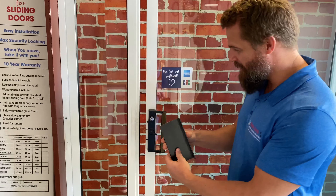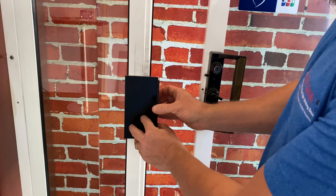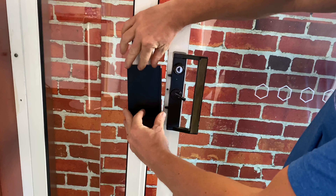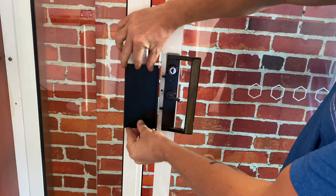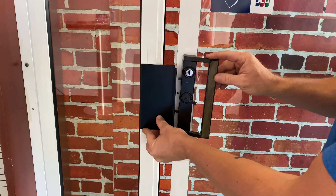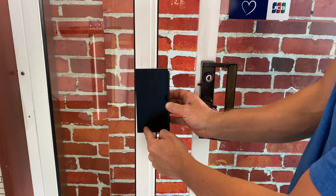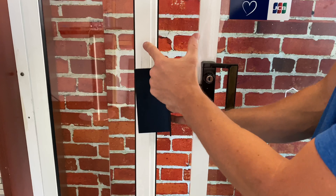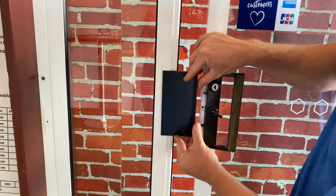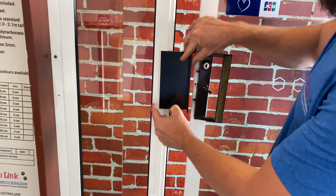In that case you'll receive one of these. What you want to do is attach it to your pet door insert, lining it up with your handle of your wooden sliding door, and you can adjust it as far as you need to, to ensure that it makes contact and reaches. You'll then use two or three screws to screw the locking bracket into the pet door insert, making sure that you're at least 15mm away from the edge so as to not screw into the glass.